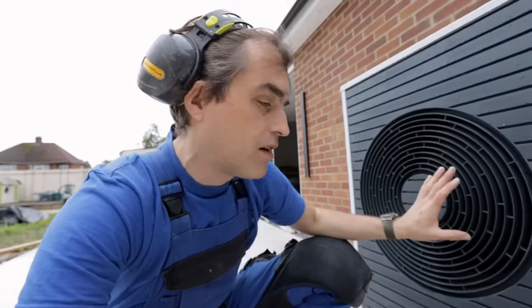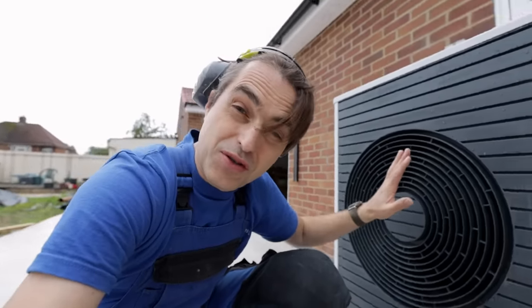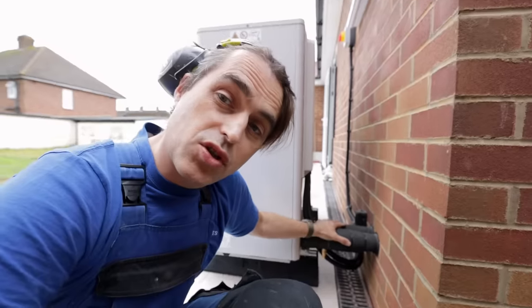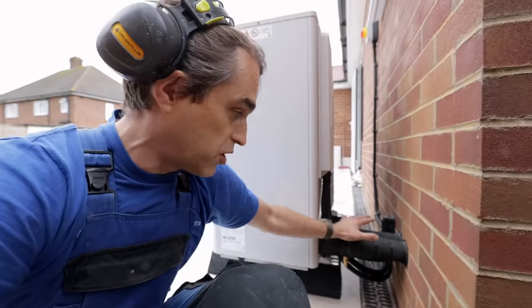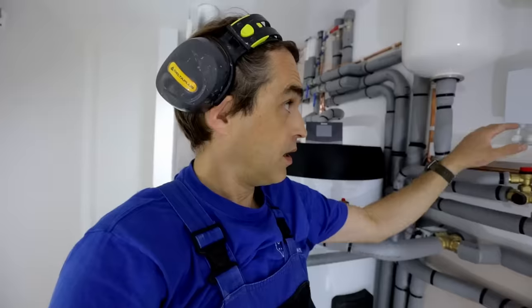The unit is now running super quiet — I checked inside and it's at 70% modulation of the compressor. I'm just next to it and there's no noise whatsoever, just tons of cold air coming out. I'm really happy with the super short run of pipework — only about 30 centimetres outside — going straight into the property. All the pipework's finished, the whole system's finished, everything's powered up and I'm ready to start commissioning.